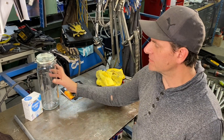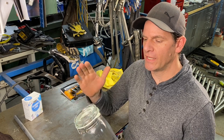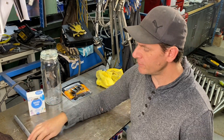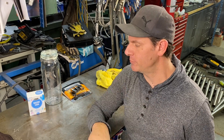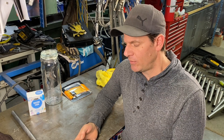The things you're going to need are some sort of container. I use this glass jar — you can pick up something like this at your local hardware store. I got this from Ikea, very inexpensive. You're going to need some water and some baking soda. You'll also need a piece of titanium to put your negative lead to — this is just a piece of titanium tube. The critical part is you're going to need some nine volt batteries. Depending on the color you want, depends on how many batteries you stack together. You need about three or four nine volt batteries and you're going to experiment with that.